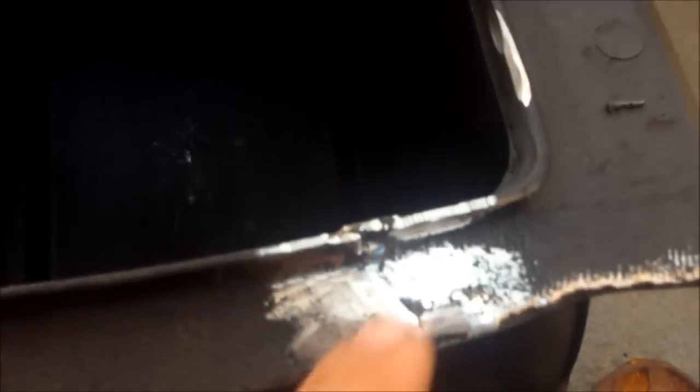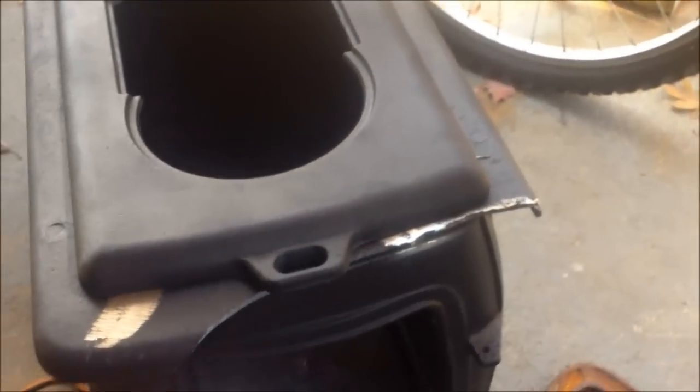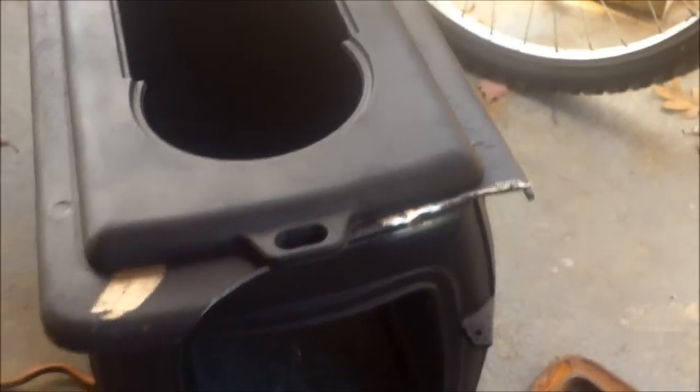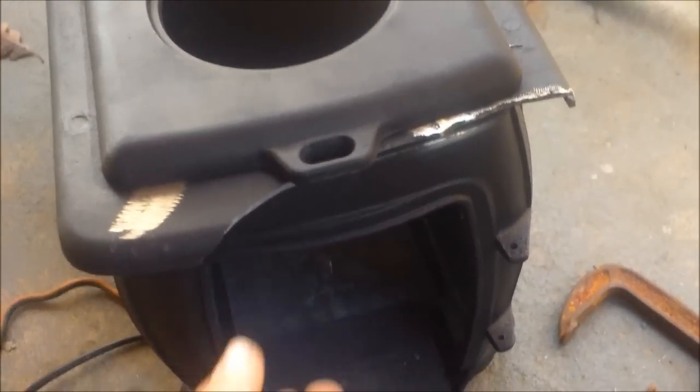After a generous amount of grinding, it looks like that. You can barely see where the crack used to be. You can leave a little bit of slag on the back side because the piece actually fits over it — and that fits perfectly. So what I've got to do now is get these puzzle pieces back together and weld them. I'll probably weld them together separately, then fit them on and tack weld them and go to town on it.